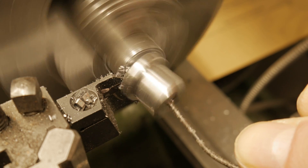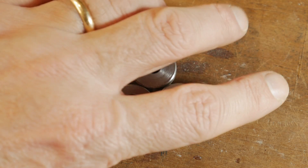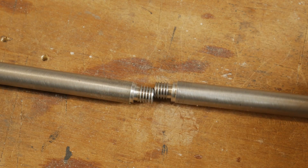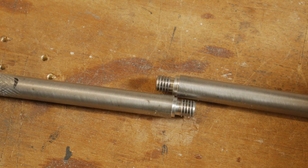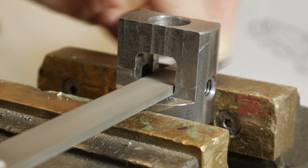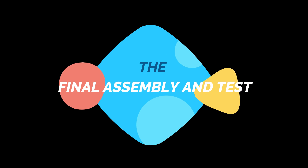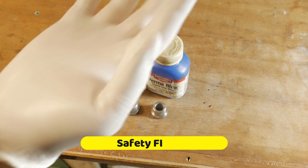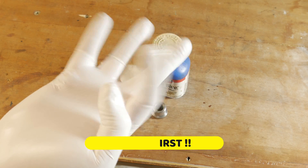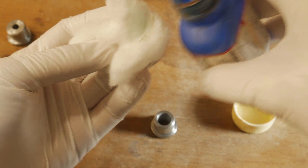My bushings and handles were finally ready. One small job remained: making the chip discharge slot square. My files proved once again to be perfect for the task — certainly not a fast operation because it is steel, not iron, and therefore more demanding. Before the final assembly I thought about how to finish the bushings, and remembered I had a burnisher perfect for the occasion — blue finish — to protect the details and make them more visible.